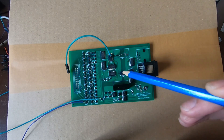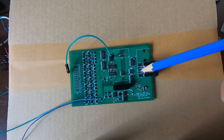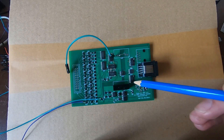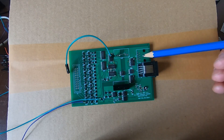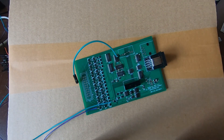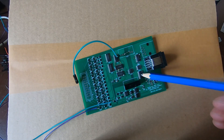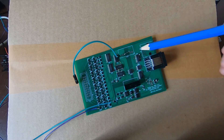Here we have a simple two-channel isolator for clock and data. On the primary side there's also some custom enable logic. This is essentially an I2C bus with chip select, so these modules can be daisy-chained. We want to select exactly one unit to talk to, and this chip lets us select between the ADC or the MUX on each module.